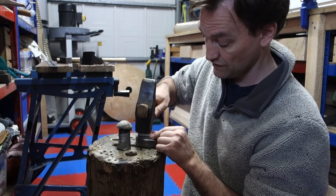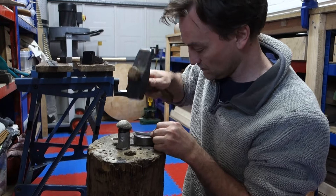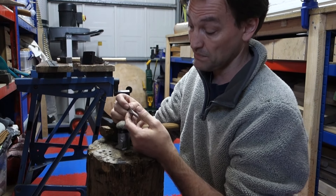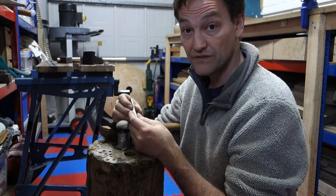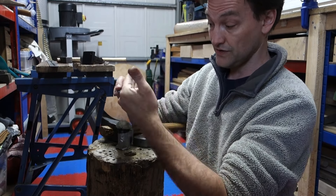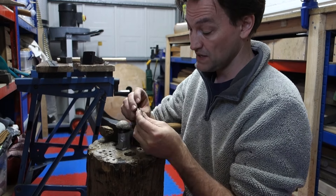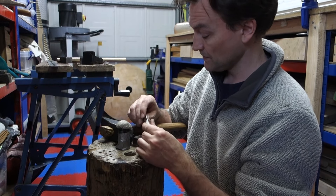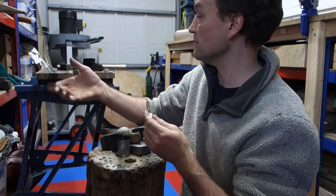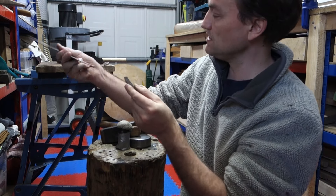Normally first I'd use the other face to flatten the metal down. You can actually see this metalworking technique on extant pieces of scrap metal from sites. Coppergate in York for example has got some very good examples of pieces of copper alloy with these ripples on the surface where the lump of copper alloy has been drawn down into something - perhaps to make various pins, buckles and things like that. Let's have a go at hitting it crosswise. We should measure it first - about 9mm, maybe 10mm.